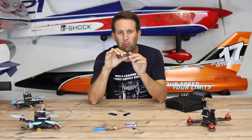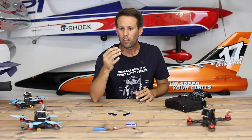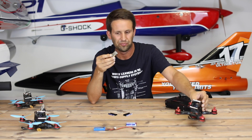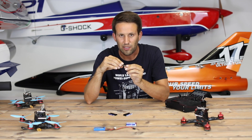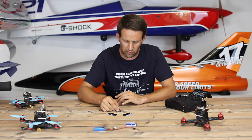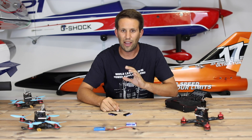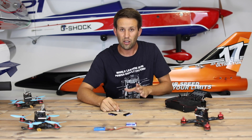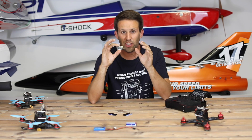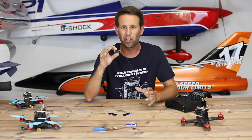We've got the receiver out of the case and we've managed to strip it of most of its pins. That's made the actual board a lot smaller than it was, and a lot easier to fit anywhere into one of my quad racers. Upon removing those pins, I was very careful to leave very clean solder joints, making sure none of them overlap onto each other, as I really don't want anything shorting out. Better safe than sorry — I've left them all individual, as they were when they came out of the factory. The next step is to see if all of this has been worth it and it still works, or if I've simply destroyed a perfectly good, brand new, not-even-on-the-market-yet receiver.